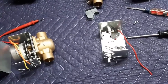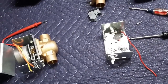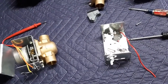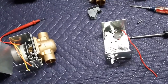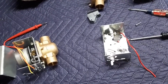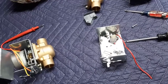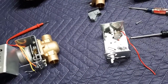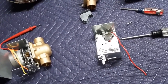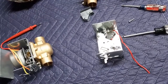I'm going to show you a way you might be able to fix your micro switch. I'm going to call it a temporary fix because I don't know how many cycles it'll last, but it might get you through a cold spell. If your micro switch goes out, you can take them apart. I'll show you how I took mine apart and bent a spring inside. There are no electrical components in those micro switches — they're mechanical, just a set of points that opens and closes.